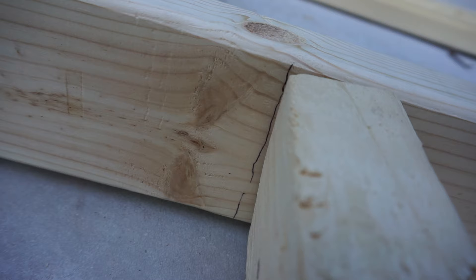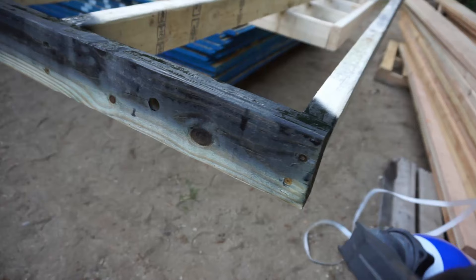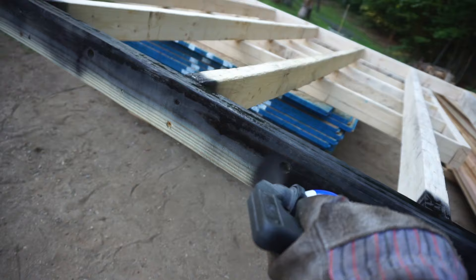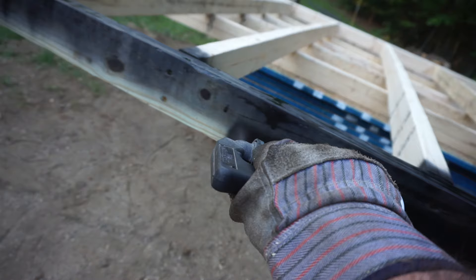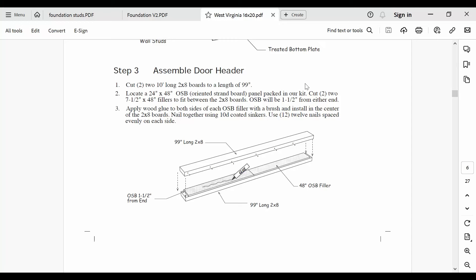Here's how we were able to somewhat alleviate the warping: I had a friend use a clamp to twist the stud into shape, then locked the stud in place with two screws. This does leave some residual stress in the wood, but again, we're just going to have to wait and see what happens. I then applied a layer of Flex Seal to the bottom of the stud walls over the pressure treated lumber. My thought is that this should seal out moisture and present a tougher obstacle for termites or carpenter ants.